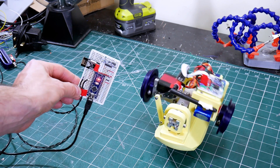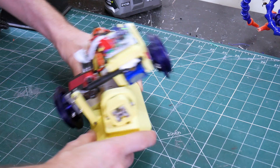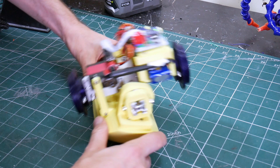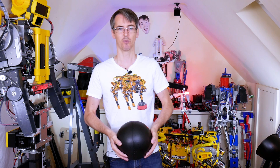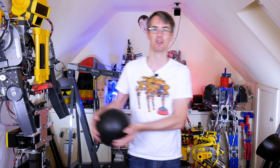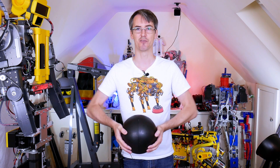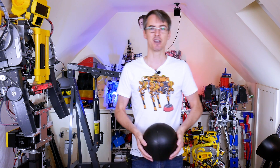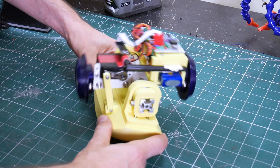We need a bit more control than that to stop wobbling when we actually steer the ball. The ball's internals are reactive to its own angle using the onboard inertial measurement unit to deaden any side-to-side wobble. Imagine holding a heavy mass like a bowling ball and starting to fall in one direction — you push that mass in that direction to push yourself back to center. The reaction of pushing it is to push you in the opposite direction, recentering you. That's why the bowling ball pendulum moves in the direction of any wobble — to stabilize the shell and keep it dead on center.